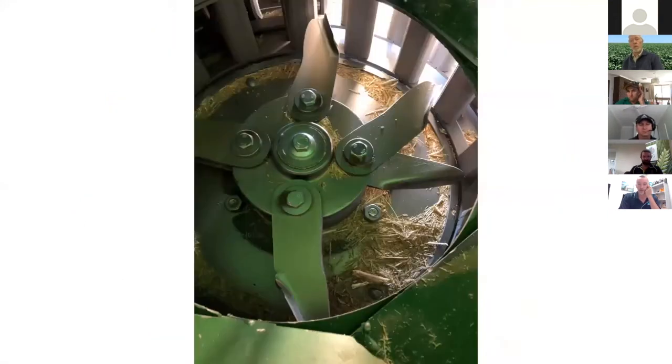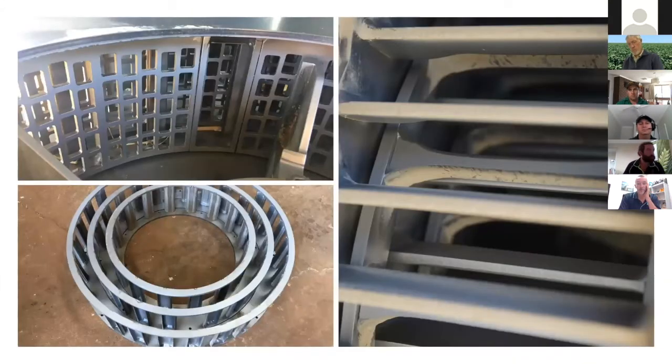And from the Redicop point of view, that's looking from the inside, looking out. They've got sort of chopper blades mounted in there. There's the first point of impact, hitting the seeds, throwing them into that first row of stators, and then 2 rows of rotors. Now, each of the mills, those 3, have a similar process.